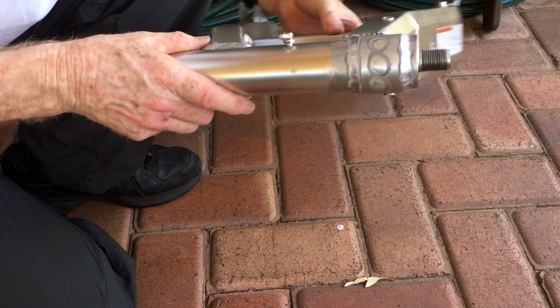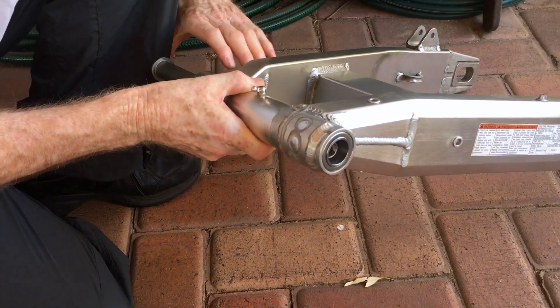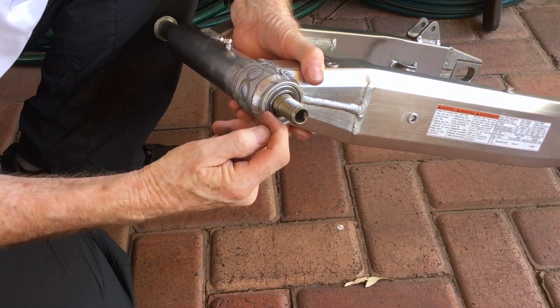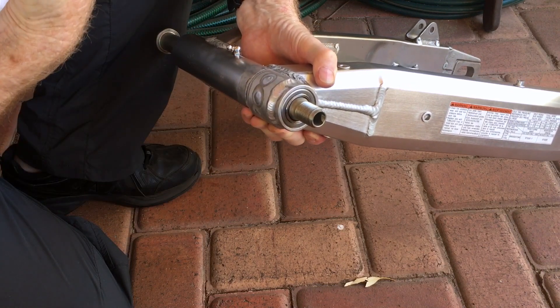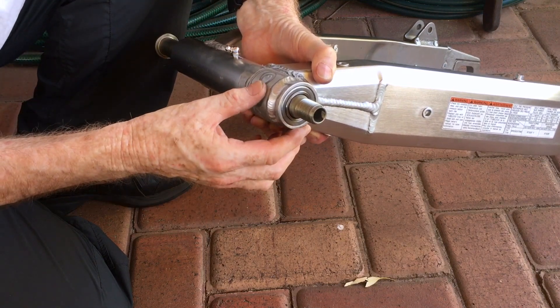What that's done in the process is effectively shrunk the diameter of this outer casing where the bearing fits in — that's the bearing fitted in there. So in order to make that bearing fit, I've had to have it machined out so it was 40mm nominal, or just under, so there'd be a firm, reasonably firm fit with the bearing.